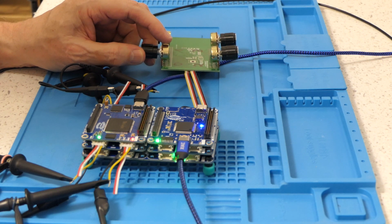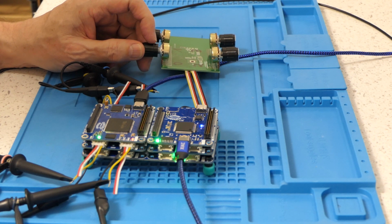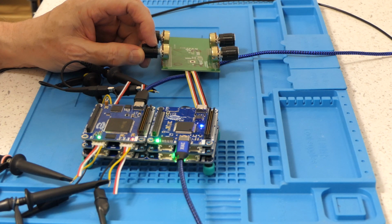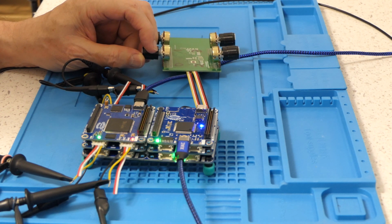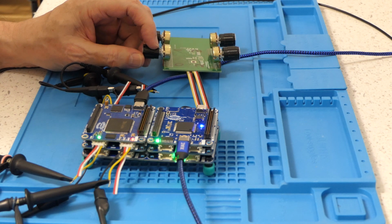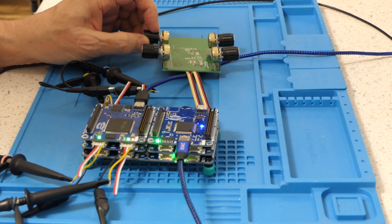These are new boards, and what this allows me to do, besides have fun, is test out all the tool set in terms of being able to compile both C code, my Verilog for the FPGA, and then make sure I can connect each of them properly, and then download the executable into the MCU flash, and then of course the bit stream into the SPI flash, and hopefully everything's wired right and works, and so far everything seems to be working okay.